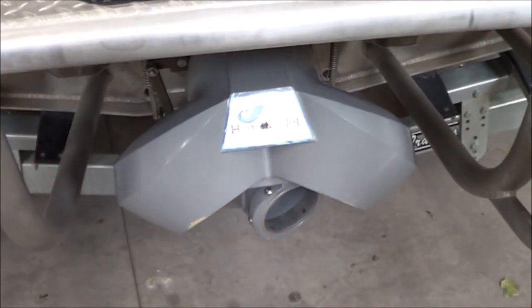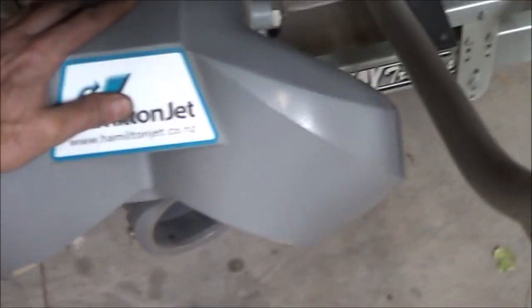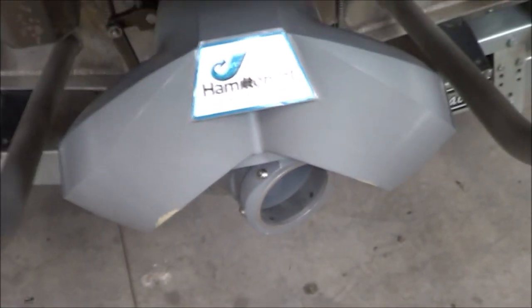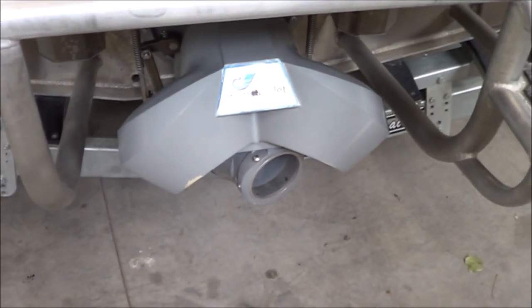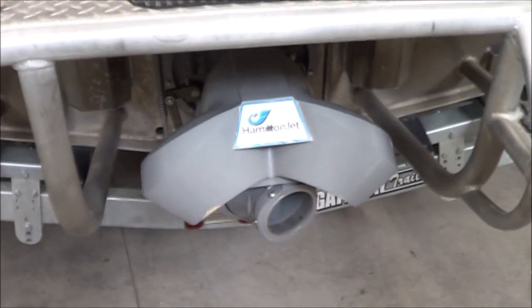We're going to test this theory, see what happens. And I'm leaning on the bucket. I'm really leaning on the bucket. So I probably got half my weight on the bucket. See, I'm bouncing it up and down. It's not going. So that little bit of chain added to the cam over that's present at the helm keeps the bucket from dropping. So now I've got, what, 200% safety?